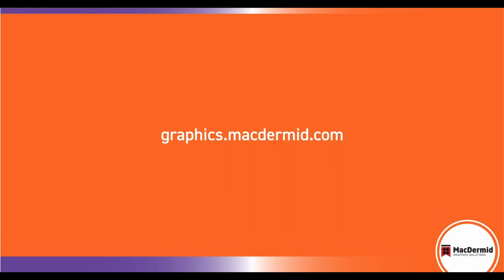Based upon a couple of years of running this technology and proving it out in the flexible packaging industry, we decided to introduce it into the LUX ITP EDGE. And what your direct print customers should see are much longer runs without having to stop to do plate wash-ups during a corrugated run.